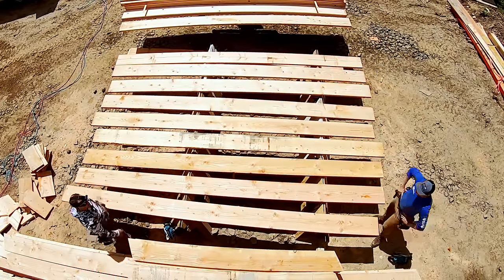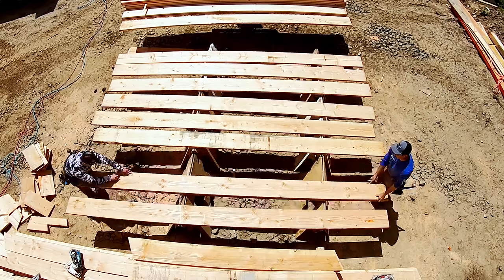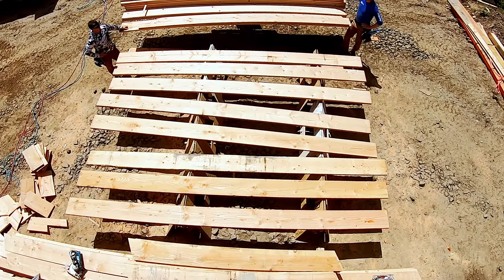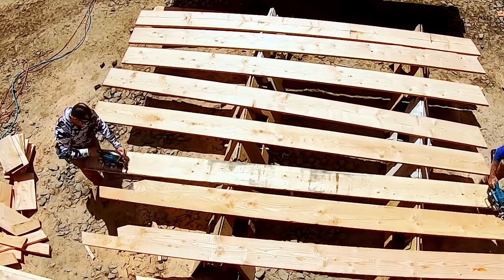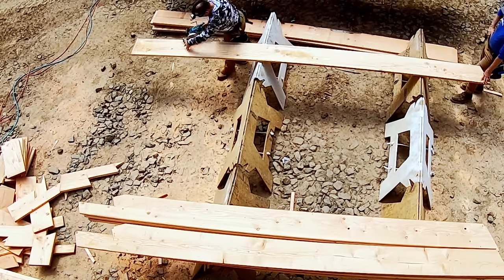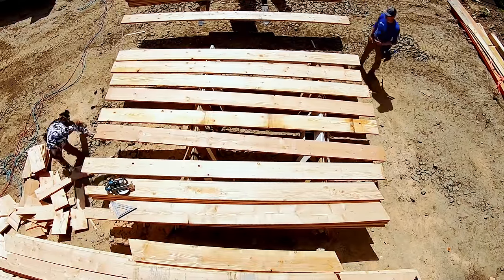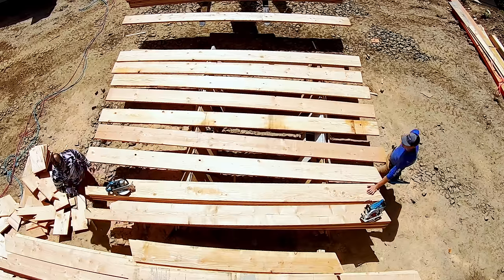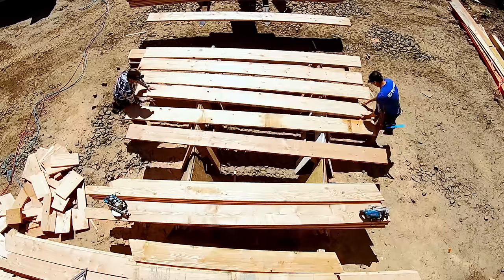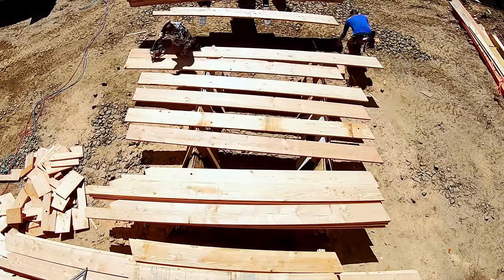Right where I was just cleaning up scrap, we have a pile of blocks cut at 22 and 7/16 inches. As we're cutting rafters, knowing we have extra length, we cut those 22 and 7/16 blocks. Those are mostly going to become our bird blocks. In some cases we're going to rip them in half with a bevel and they'll become our blocking at the top of the rafter at the ridge — that's our boundary nailing for the roof sheathing, and it also acts like a pressure block. Essentially we're cutting our blocks at the same time we're cutting our rafters, which helps you save a step.